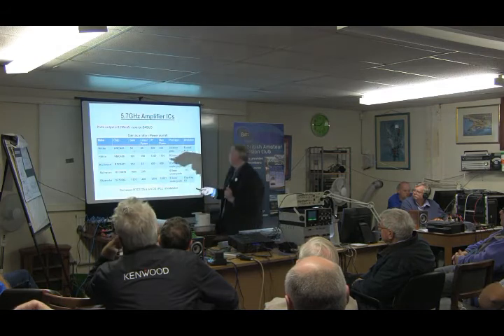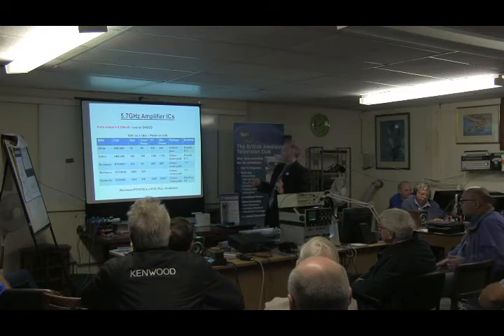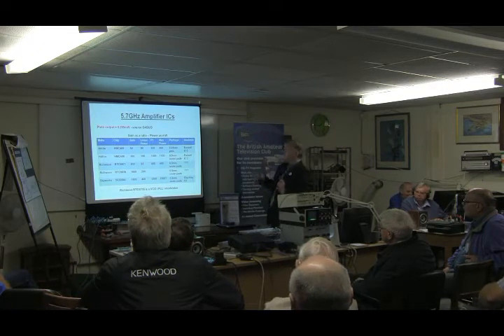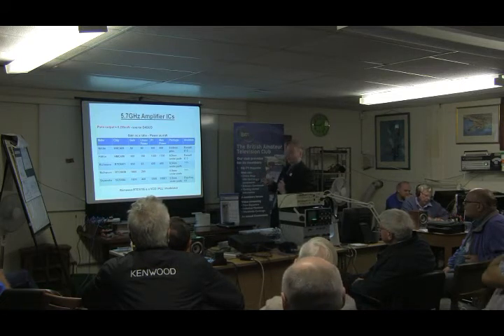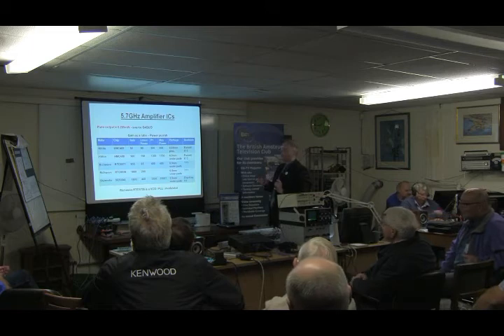Let's go back to that one. We need the gain of 1,600. If you've got a quarter of a milliwatt times 1,600, that's 400 milliwatts out. So that should be equivalent to, say, 10 to 12 watts on FM — quite potent. And these, in some of the FM-ATV transmitters, have been driven to 2.5 watts out. I've got one of those coming as well. Goodness knows how the little things don't melt, because they're only about 4mm square.